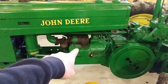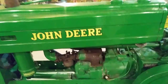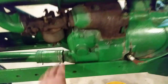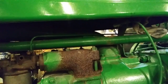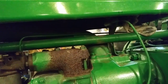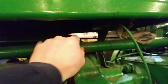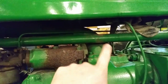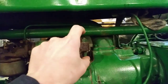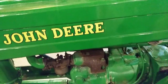The project for tonight is going to be re-plumbing the fuel line on this 1941 John Deere H. The sediment bowl was leaking, the packing was bad on the shutoff valve, and the three-way valve was also leaking — the packing was bad on it too. So I removed both of those. There should be a sediment bowl here and that three-way valve. I removed them both and took off the old line. The old line had a piece of hard line, then a section of rubber in the middle with a lawnmower add-on filter. It looked really janky on this tractor.